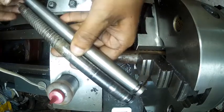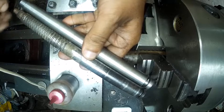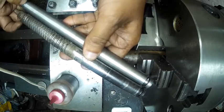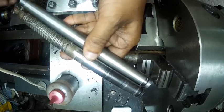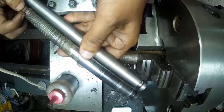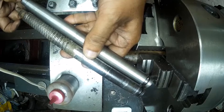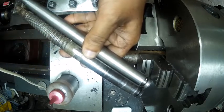This part I will machine a little bit when I am cutting the thread. In my next video I will show you how to cut the square thread over here. This one I have reduced to this size because this will give me the thickness, that is the depth of the thread, the exact measurement of the thread. So I have just cut it inside. You can see the inner piece inside the thread and the depth of the thread. So that depth I have kept here, so that when I am cutting the thread over here, it becomes easier for me to measure.